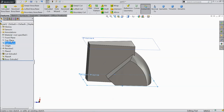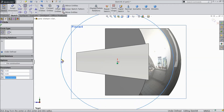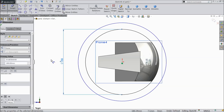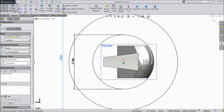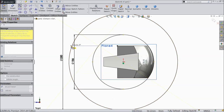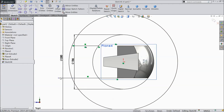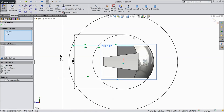Select right plane sketch, click normal. Now choose a circle and draw two circles. Draw another circle. Select smart dimension, assign diameter 186mm and 330mm. Choose line and draw one line parallel to this. The same line — both lines should be parallel.